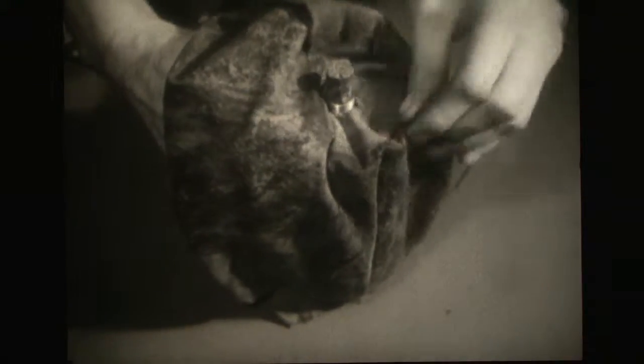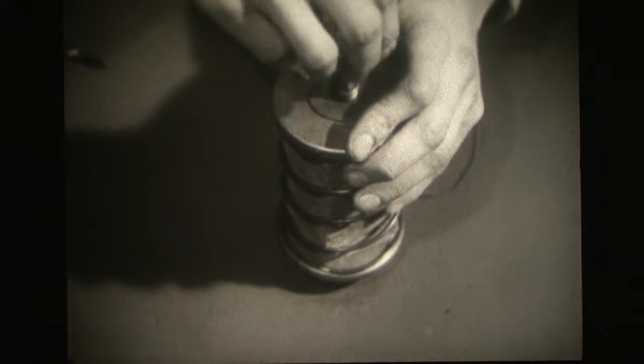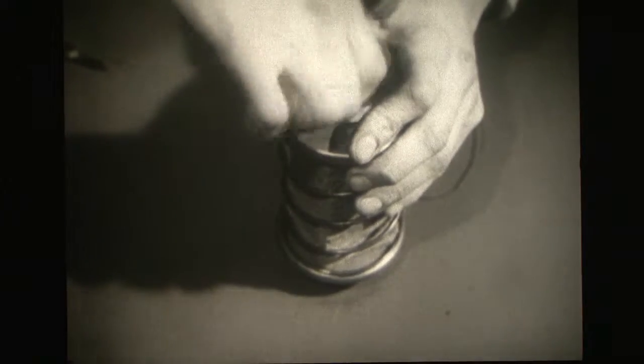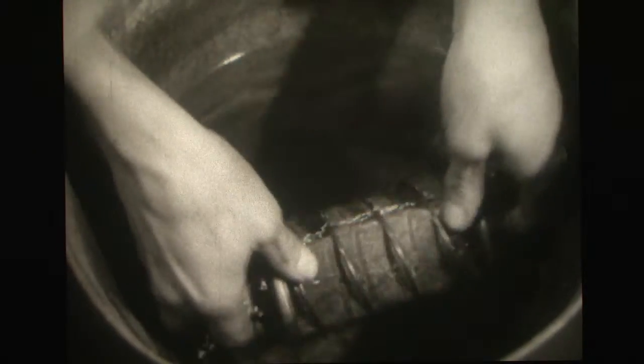After removing the dirty cloth, the nut of the filter element must be replaced to keep the felt pads pressed together. The cloth should be thrown away, replacements are very cheap, but the felt element can be cleaned in petrol or paraffin. You will see that the cork plugs are essential to keep the dirt from being washed into the clean side of the filter.